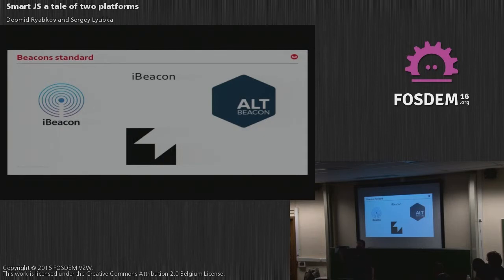There's two other things that you find in most beacon standards. There's a byte to tell you about the range you want the beacon to work at. From a range perspective, a beacon like this, Bluetooth LE, is about 50 meters. And you can decide that range. You can configure that range offline.